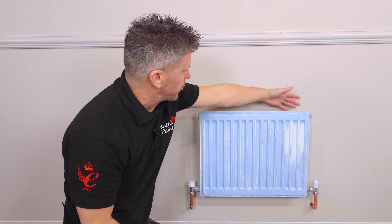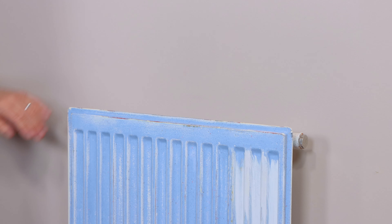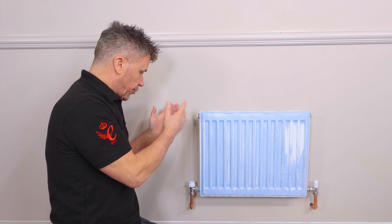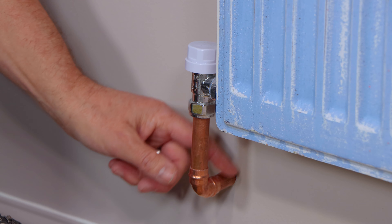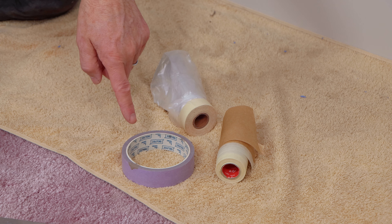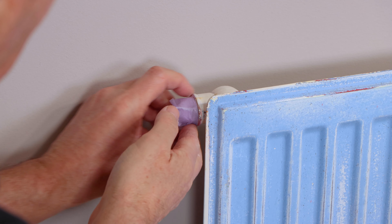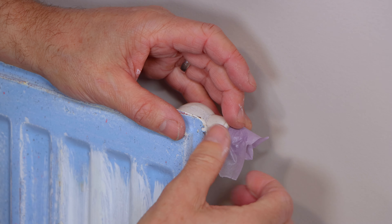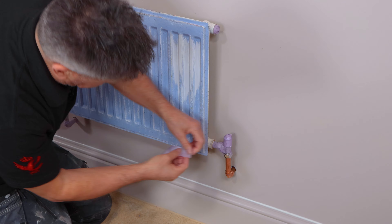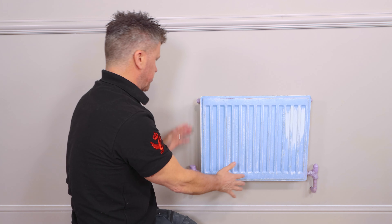My next stage is I want to protect the surfaces around where I'm not going to paint, which is the plasterwork behind, some of the detailed work on the side where the plumber may need to get or you need to bleed the radiator, and of course the valves and the pipework. You can use different types of masking tape for this — some with polyfill, some paper ones and some standard masking tape. When masking up these areas, do take your time to assure you mask it right. This will ensure that you don't get any excess paint on the areas where it's not required. So that's the pipework covered on both sides and at the top.